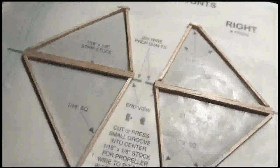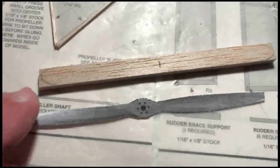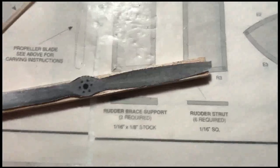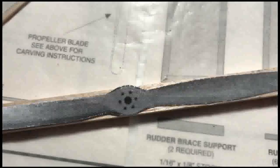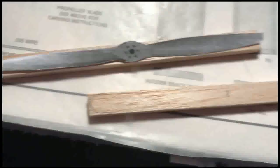The propeller mounts are built and now we have to make some propellers. I've taken a picture of a propeller and sized it close to the length needed for the model. We'll place this layout on top of the piece of material, mark the outlines of the propeller on both pieces for both props, and then either dremel the shapes or hand-carve and then dremel. We'll get back and show how that turns out.